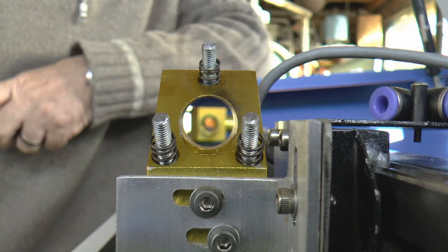This is a very convenient point to stop Part 1 of this two-part series. We've achieved the line of sight between the cutting head mirror and the laser tube, which is a very important feature of this procedure. In Part 2 we'll go through a procedure which aligns the laser beam very accurately with the x and y axes of the machine in both the vertical and horizontal planes.